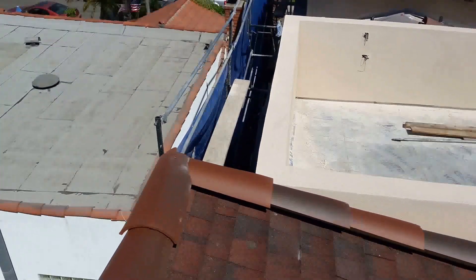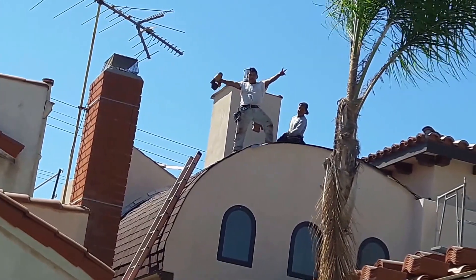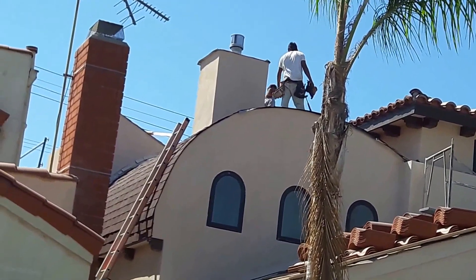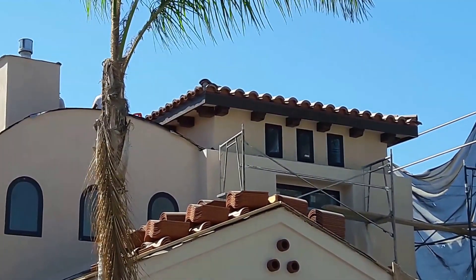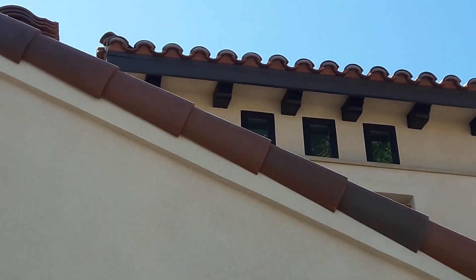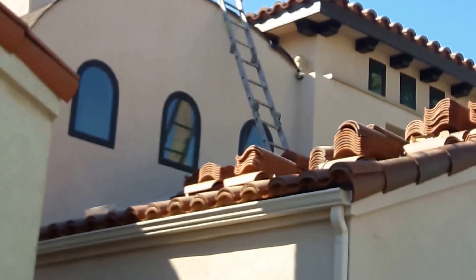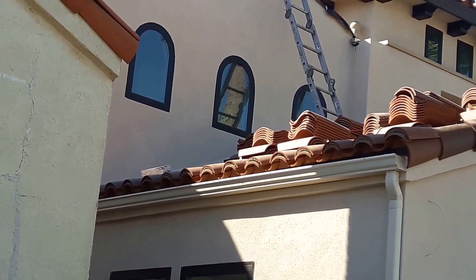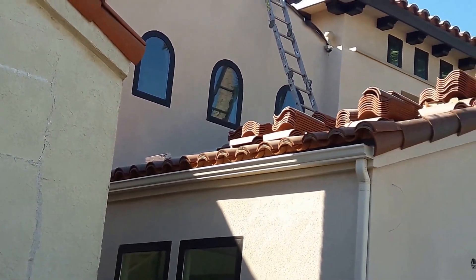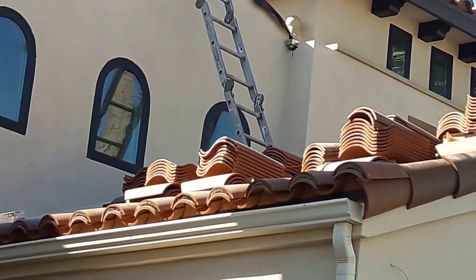I think I have a video about that tile — I'm going to put it together with this one. This is just like a rake on the edge. I'll show you from the back. This is how I start my first course of the two-piece tile, and then I'll continue with one piece. You see the top over there — this is how it looks: two-piece with booster. I've already installed my rakes.